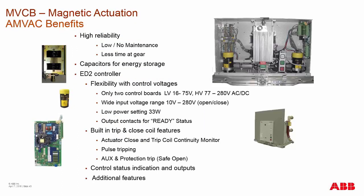That low amount of moving components gives you the low/no maintenance and high reliability. It's also a high safety factor because less time that maintenance personnel have to go around and check on the breakers, the safer things are. And you do get a long-term cost savings with that.